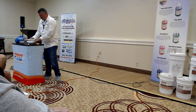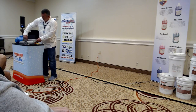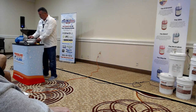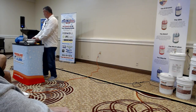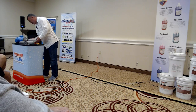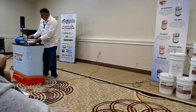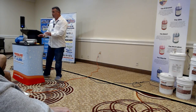What you guys need to be concerned with, that a lot of people aren't really concerned with, is this first one. There's basically a lip inside here where the first bowl goes in. When you clean this up, make sure you clean that out, because that's a point where it can bind. And there's a certain amount of shims in this first one. Always put that exact amount back in there, because you want to keep distance off of that shoulder right there. Whatever you see when you take it off, put it back like that.